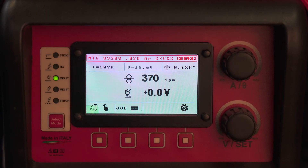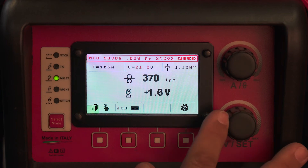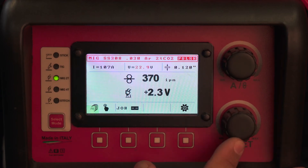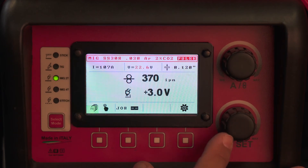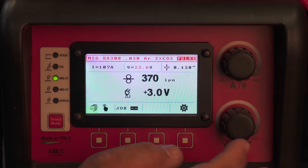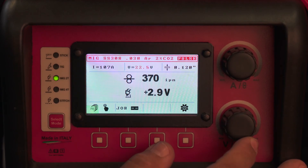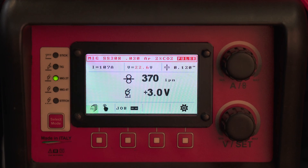When you hear any crackling — like firewood crackling — you need to raise your voltage up to where the crackling stops and your arc cone goes from an occasional short circuit to a true spray transfer. In some instances, depending on how your gas is mixed, you may have to go as high as positive three volts. Typically on most other programs an adjustment would be plus or minus one or two, but on stainless, depending on how cold your gas is, it can be a little bit higher.